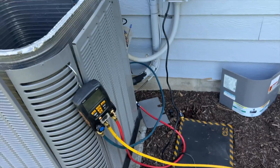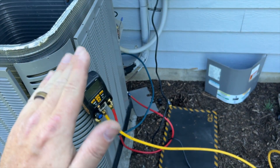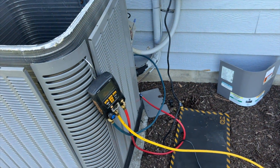We're getting to the end of our recovery — we're at 3.9 psi now. Keep in mind if I were to close these valves it would pop up a little bit, so I like to try to get as close to zero as possible. That'll leave maybe three psi left, which I'll purge out when I run the nitrogen.